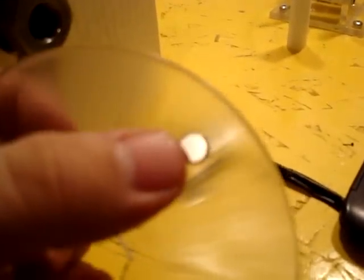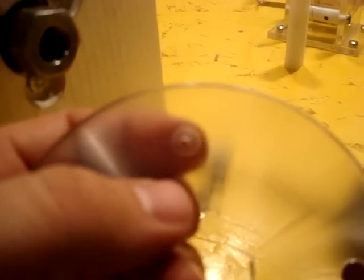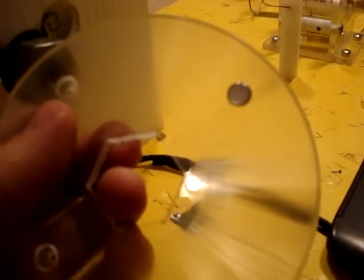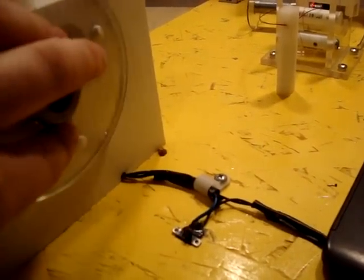If you'll notice here, there are some holes that are drilled, and those holes actually hold the magnet. I can take this off to show you — all it is is a little neo magnet just pressed right in. I drill a small hole in the back for two reasons: one, it lets the air out, and two, if I ever have to pop the magnet out, it gives me a way to do that. That part just slides on there like that, and it's got a confirmed lock.